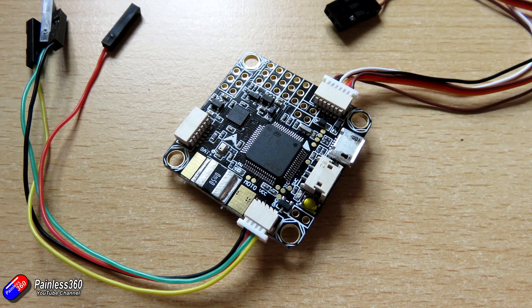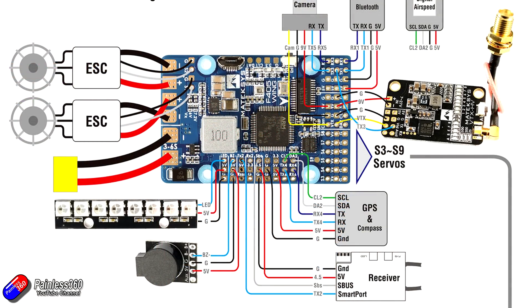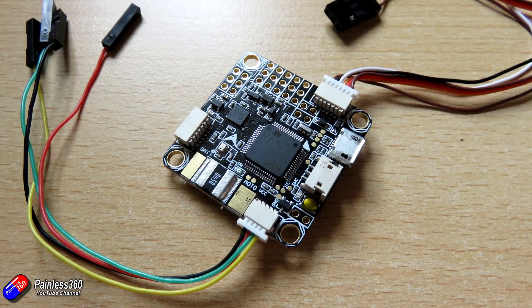There were a couple of reasons why I ended up not using the F4 Omnibus. I need a UART for the GPS, a UART for FrSky telemetry, potentially a UART for camera control for the RunCam, a UART for smart audio to configure the video transmitter, and potentially a spare one for a Bluetooth transceiver so I can upload and download information wirelessly without popping covers off and plugging in USB cables. You simply can't do that with just three UARTs, so in a wing where everything is hidden away, I decided to just bite the bullet and put the Matec in.